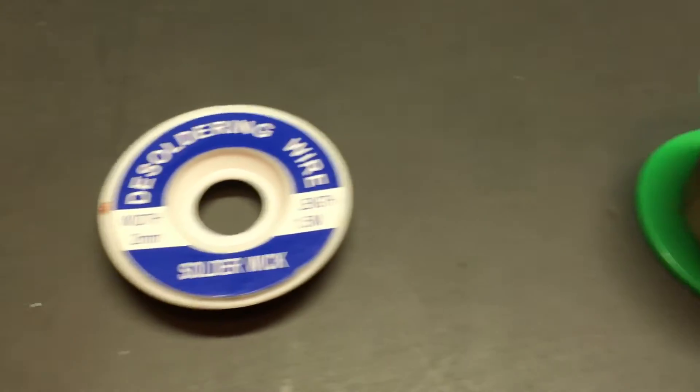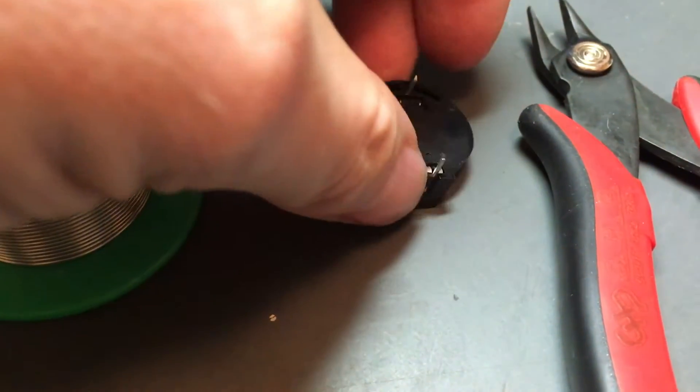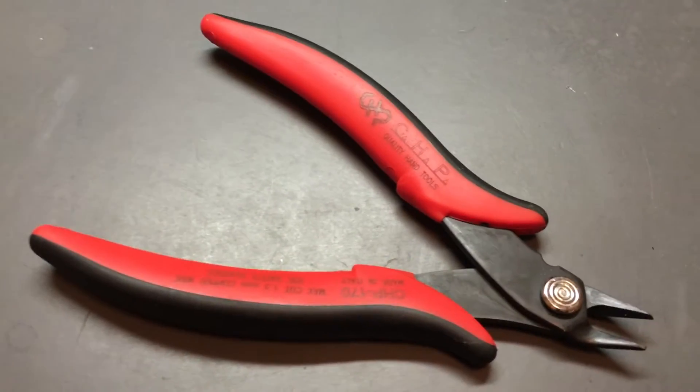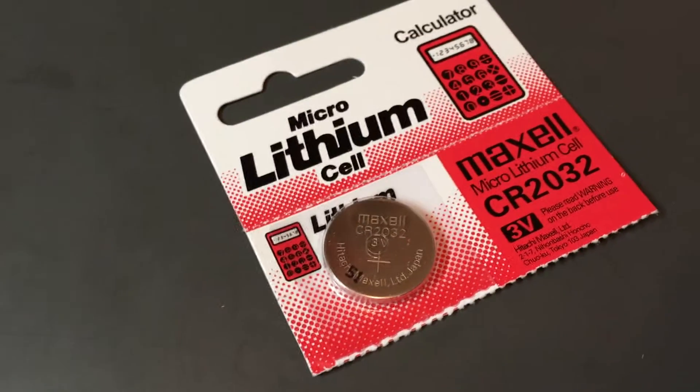To fix this, you're going to need a screwdriver — a Phillips — some desoldering wick, some fine solder wire, and a new battery or a new battery clip. This one has little pins so that it can be inserted into a circuit board. You're also going to need some clippers to cut the wire ends, some rubber gloves for touching the more sensitive parts, some wire strippers, some spare wire, and of course a new battery.